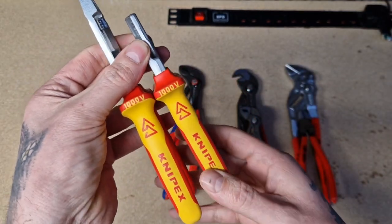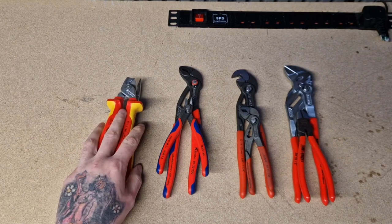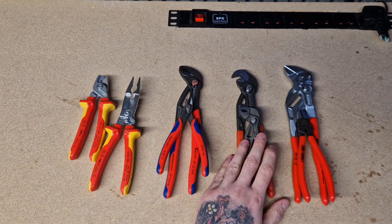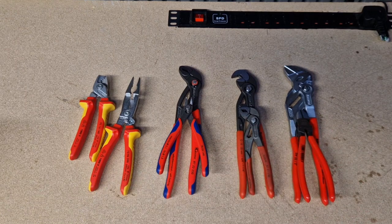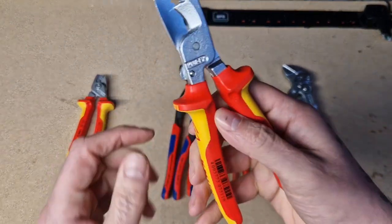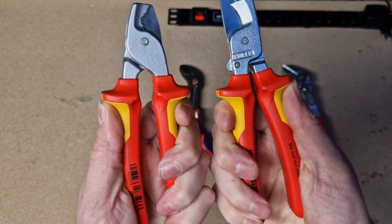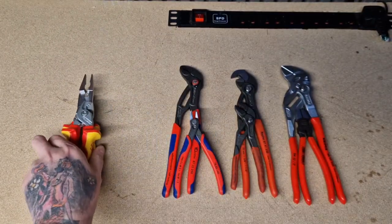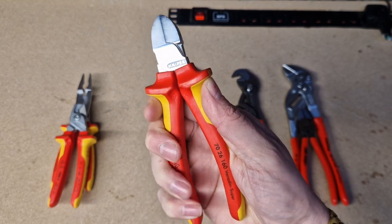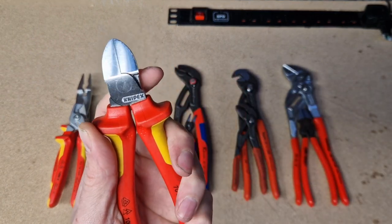All denoting a thousand volt tested rating. It's very clear with the colouring as well. So these are for working around or intentionally on live electrical. These are your comfort grips, textured, and your normal vinyls. Also, if you notice, these VDE ones have got little ears that come out to stop your thumbs slipping over and hitting the conductor. That same guard is on all of them — the little thumb and finger guards stop your fingers rising up and over and contacting a conductor.